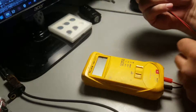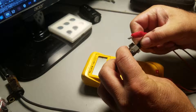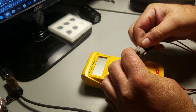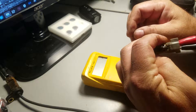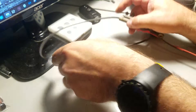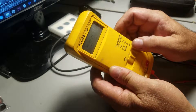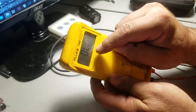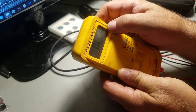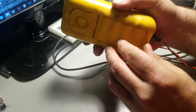So what you do is — it doesn't matter whether it's plus or minus. There's only two wires, and make sure they're not touching each other, otherwise you would get full continuity. Turn it on, and right there you see that it's an open circuit and it's measuring ohms. It knows automatically because it's on automatic selection — this whole thing is just automatic, which is pretty cool.